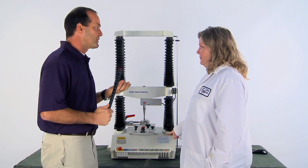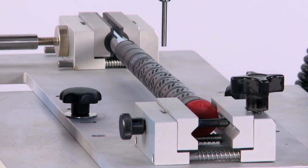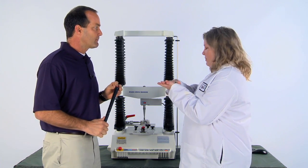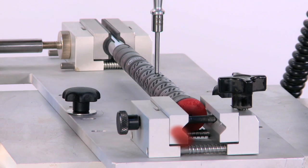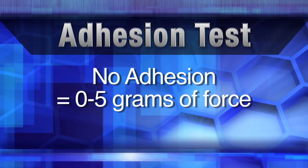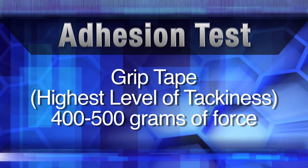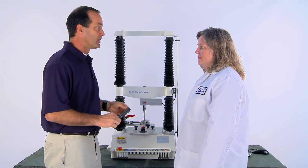Can you tell us exactly what this test is? If you put something in here that has no adhesion or no tackiness to it, what would happen? Basically, the machine puts the probe down on the sample that you're testing and as it pulls away, it measures the force that it takes to pull off of it. If there's no adhesion whatsoever, no tackiness, you're going to have zero to five grams of force. The grip tapes that you may use will have four to five hundred grams of force to pull away. So the more force it takes for the probe to release from the material, the tackier the material is. Yes, that is correct.